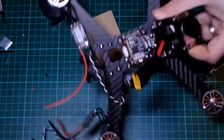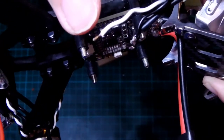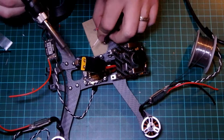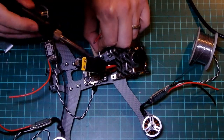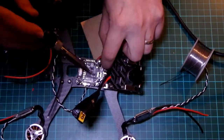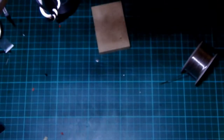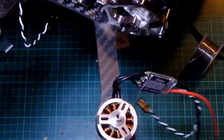I keep talking about the difference between silicon wire and normal wire. This wire here — the coating just melts the moment you put any heat near it. Whereas the silicon wire takes the heat so it looks a lot nicer and it's a lot easier to use. I'm going to do the signal wire first because it's the smallest. I'll clip a little bit of the end off, put that against it, and solder it up. They're shiny so they are okay — they are strong enough.